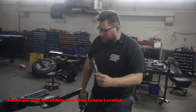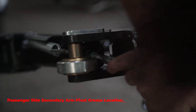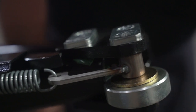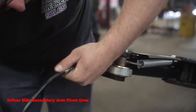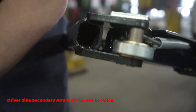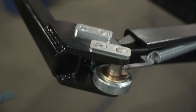Next, we've got a grease fitting in the end of the arm here. This doesn't take much at all — about two seconds. You can see the grease oozing out on the top, which means you got the grease in there and into that bushing too. Same with this side: one right in the end, oozing out — we know we got it in there.